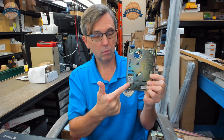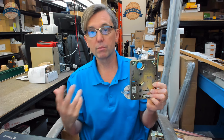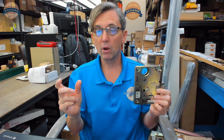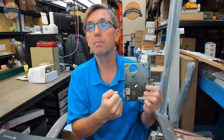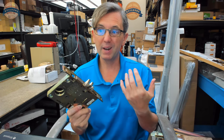If there were a question over the integrity of the fire rating of an opening, you should be able to remove all the parts and visually inspect to make sure each has a label. For example, a door viewer approved for use on a fire door will have a label on it when removed — if it doesn't, it's not been approved or it failed testing. Steel or ferrous-based hinges and stainless steel hinges don't have to have an actual label attached, provided they're ball bearing and within the proper size range for the application. But everything else does.